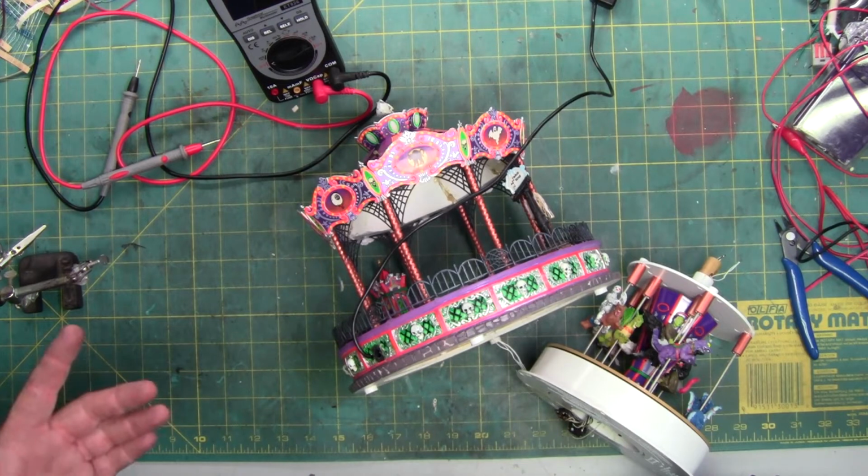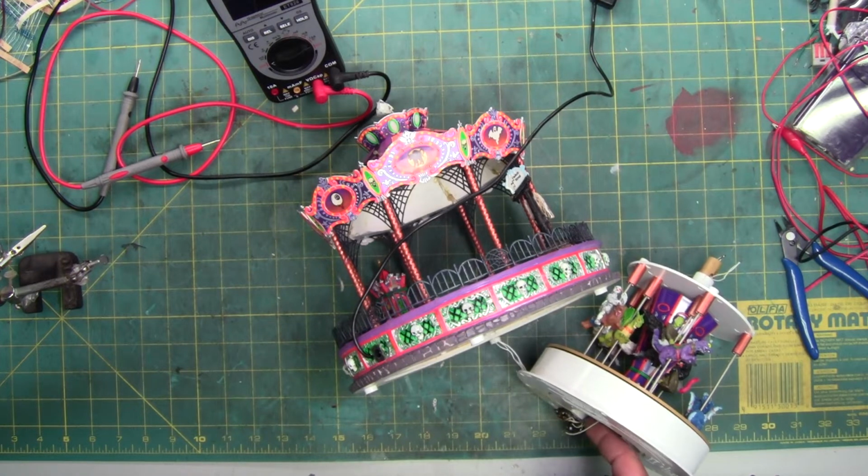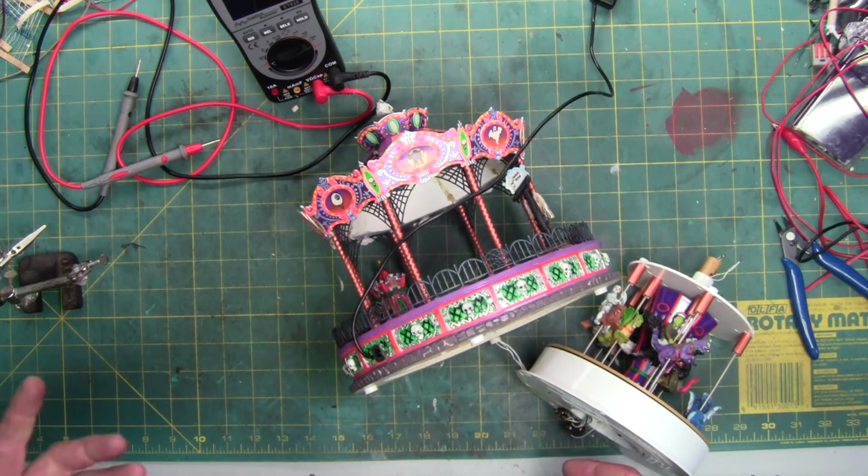All the resistors I can see go to the lighting, which indicates to me that there's something shorted in the lighting. So instead of the lighting going on and being on, they're either really dim or not on at all because there's a dead short and that resistor is getting extremely hot on two of the resistors. On the third resistor, which is on the board, it's actually the resistor that comes off the speaker, the sound chip. And the reason that one might be burnt is because these two wires are broken. They might have been touching, could have burned it, or something else caused it.